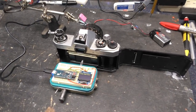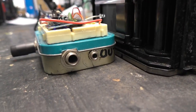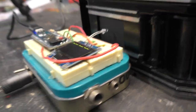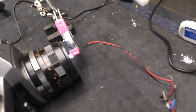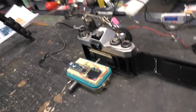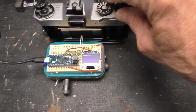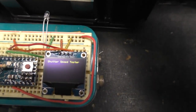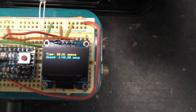Let's take a look at my test rig. I've got the old LM386 audio amplifier can holding up the breadboard, lined up centered on the focal plane shutter area, perpendicular to the camera. This is an older Pentax SP2 that I've got to do some work on. On the other side we've got the LED pointing right into the center of the lens, fairly close, running off a 9-volt battery. The shutter speed is set to 1/60th of a second. I'm going to fire off the shutter — 1/49th of a second. So the shutter is a little off.